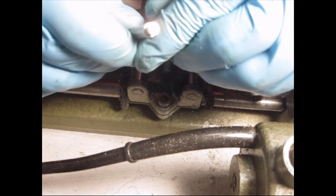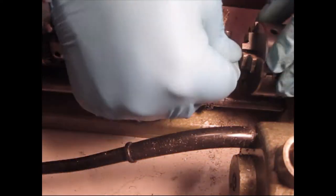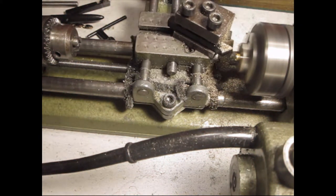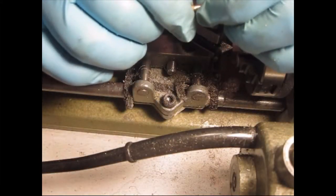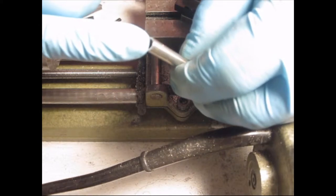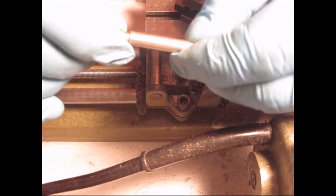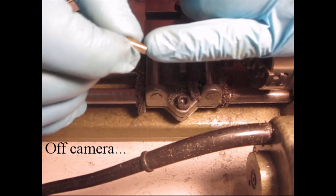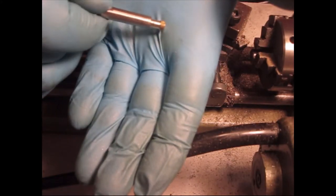They're set up quite nicely. And I just wanted to trim it and give it a nice decor at the end. This is cute. This is definitely good enough for my needs. My mistake, there was a burr inside here which I didn't notice, so this is now undersized. I'll repeat the whole process and make a new one that is 4.3 outer diameter, not 4.0. So this is the final knob.